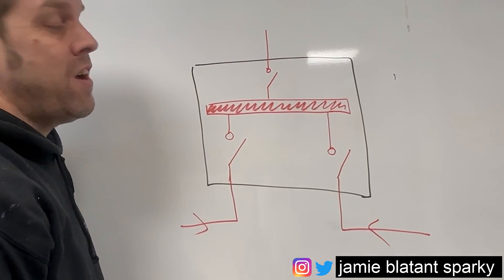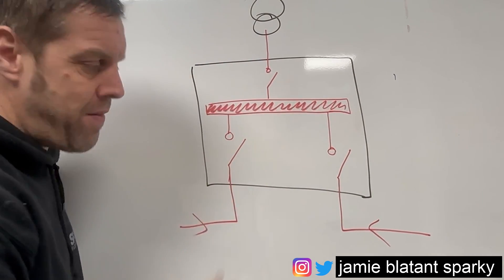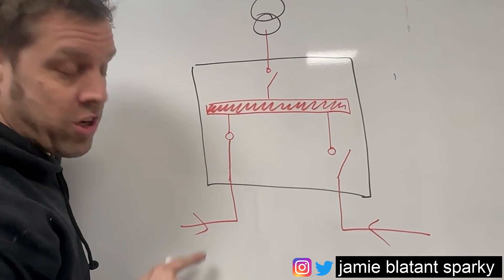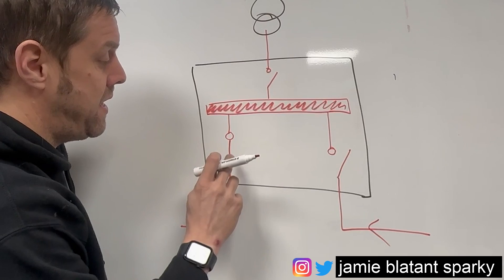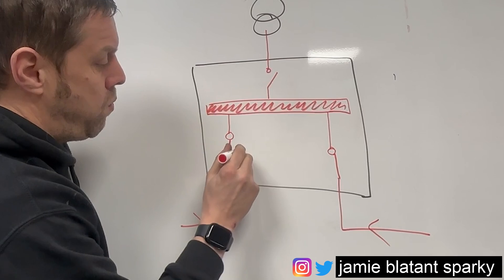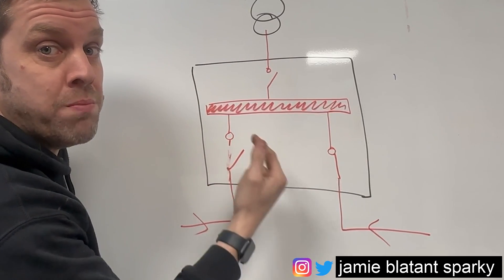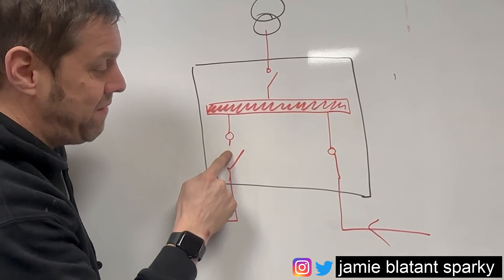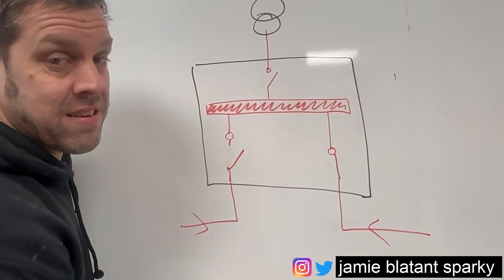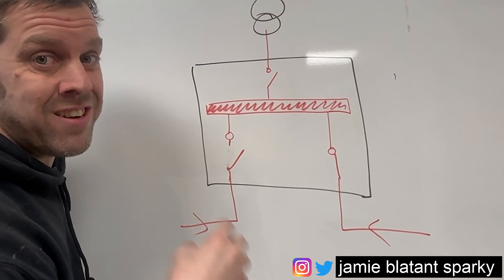The T has a T-bit, and coming off there there will be a device - which is probably protective - which will feed some sort of HV load, more often than not a transformer. The clever bit is: if I close this one I feed the transformer from this end. If I then close that one and open that one, I've fed it from this end and kept the transformer live - I've paralleled it up by closing both, kept the transformer live, then switched this one off. So I've effectively swapped from this side to that side without any effect to the outgoing load. That is the main secret of an HVT for keeping the lights on everywhere.